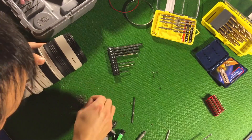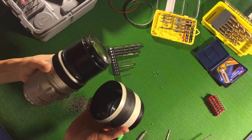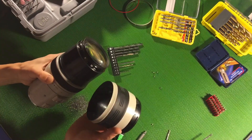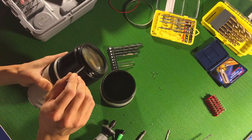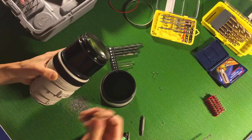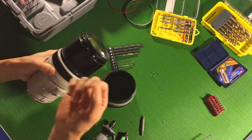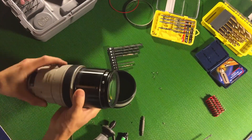This one is also chipped off — but now, wow, this one is open! So after almost 15 minutes of powerful drilling, this one is done. My experience is: first, try to use reverse drill bits because otherwise your drill will not be centered. Using the reverse drill bits keeps you centered while making the hole larger. Finally, use the power drill — still centered — and drill deep. As you can see, this bolt is very long; you have to drill to a depth of at least four millimeters. Now the front element is off.